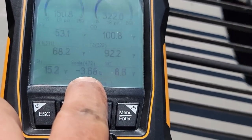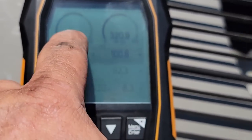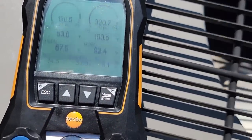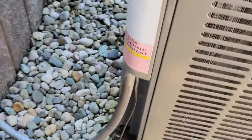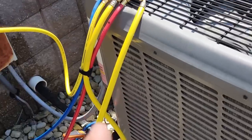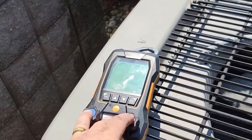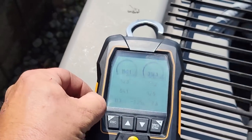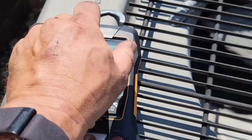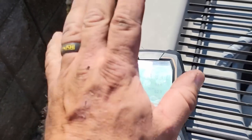On the weight scale - I already added one pound, so grand total we've added 4.4 pounds. We've got 15 degrees superheat, 8 degree subcooling, 321 and 150 on 410A. This one's good to go. Haven't checked temp drop yet on this one or pressures to see where we're at, but everything indicates it's probably working just fine. These are awesome gauges - I've been really happy with them, still got to figure out the probe thing. These are the 557s. The writing on them wipes off pretty easy, they need a better ink job. But otherwise they've been awesome.